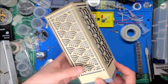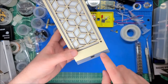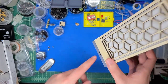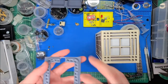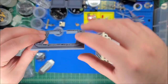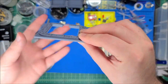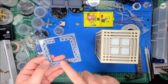Let's pop this open. On the bottom you can see I spent quite a bit of time measuring to get the USB port placement just right. I even modeled the actual PCB in CAD to make sure it would fit with tight tolerances. I used the same trick I've used on several other projects — designing the model and then in the slicer dropping it below the platform to only render the top part and check clearance, so I don't have to print the whole thing.